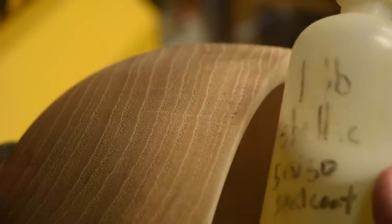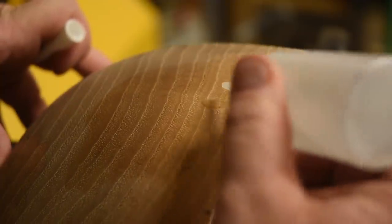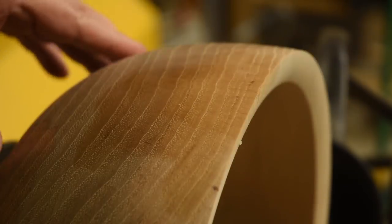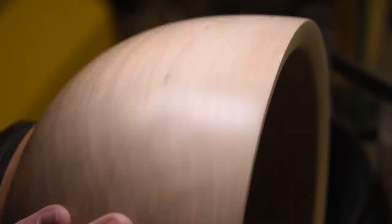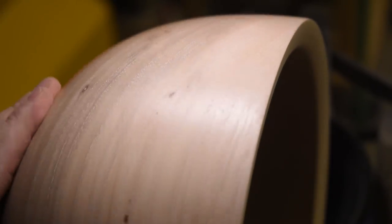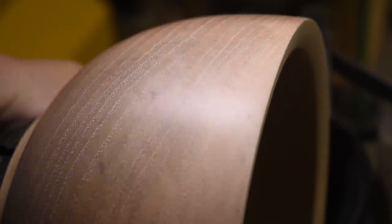I did reveal a couple cracks on the outside. So a trick is to put a little sanding sealer, which is shellac, right around it. And then drizzle some thin CA. The shellac means that the CA is not going to bond with the outside. It's just going to soak in. Then that paper towel, I just kind of spread it out and drive it in. It kind of cures it a little bit quicker because it's cotton. And then you sand it and you won't see the CA glue. If I didn't put that shellac in there, there would be a little dark patch